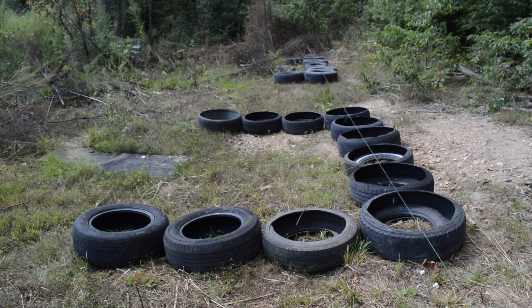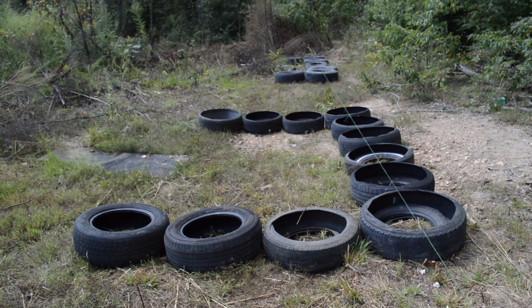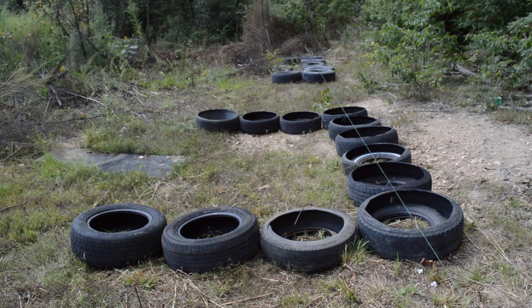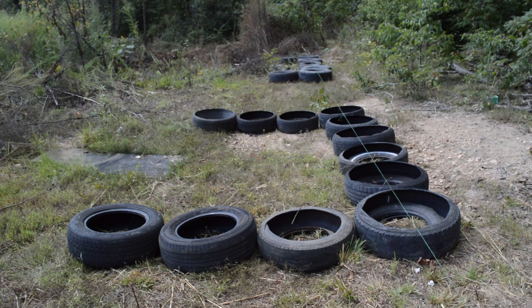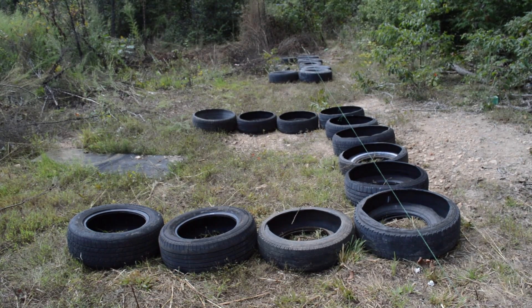What these rows are — they're going to be a foundation for a variety of buildings. Instead of digging down under the frost line and putting in gravel and cement and all that traditional construction stuff, we're going to use tires. Because tires are so wide, you can get by without having to dig as deep.